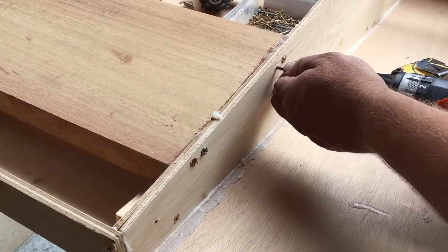Use a paddle pop stick to get the nice curve, then use a nice big clean-up blade to get in next to it and pull the excess away. Straight in the corner like that - don't push too hard that you bump the other side. Pick it up and push it in. Take it right up about 10-20mm short of the top - because we're going to have timber go up around there anyway. Just pinch the excess away. That's what it needs to look like.